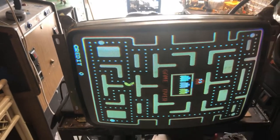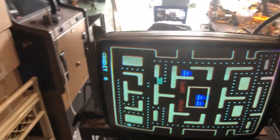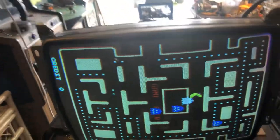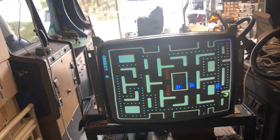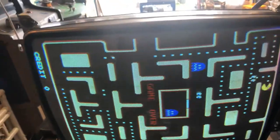I went through the chassis, did a lot of reflow work, found a few cold solder joints, did a cap kit, and now we're up and running and looking pretty good. It's been on my testing bench for many hours, and no more vertical collapse.